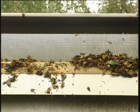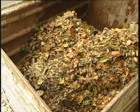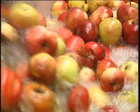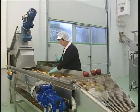The flushing water is pumped via submersible pump to a rotating screen to separate the basic dirt, leaves, and grass that accumulates over time in the water. The cleaned flushing water is recycled and reused to discharge the apples from the silos using a second submersible pump.